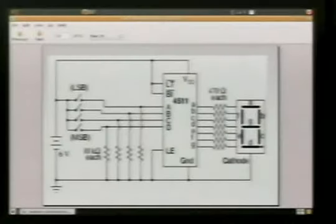And then these are the resistors coming out from our chip that limit the amount of current and don't blow up our 7-segment display, because it's driven by LEDs. So we've got to keep our LEDs blinking. So we need resistors.